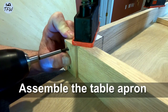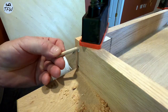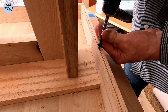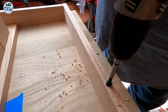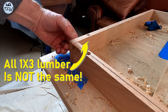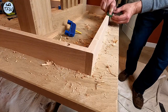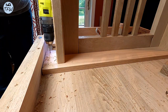I'm going to build a small two-and-a-half-inch apron for the underside of the table, using oak dowels to put these together. I'll use a Forstner bit to provide a relatively deep hole so that I can use long cabinet screws to attach the apron to the table. Everything is pre-drilled, and these help lock the apron down to the tabletop really well. There was a surprise with the one-by-three lumber I thought was all the same — I had to do some plane work to get everything squared away. Then I used my mini plane to chamfer the edges and take the hard corners off the apron, because nothing's worse than dragging your knuckles or knees on a sharp edge while trying to enjoy dinner.